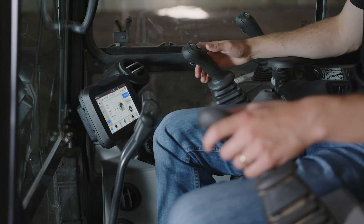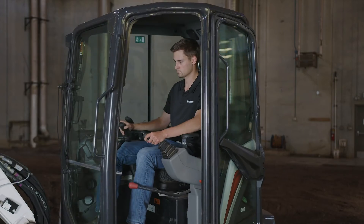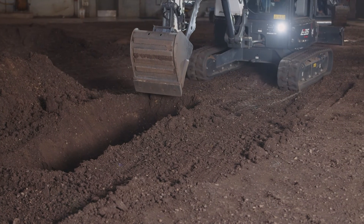The operator must be able to reach that grade point. After re-benching, I'm free to continue digging my trench. Continue moving back as you finish each section of the trench until you've completed the entire trench.